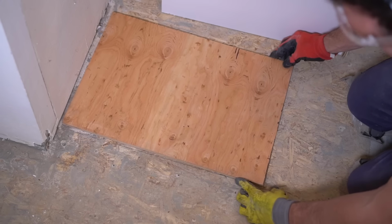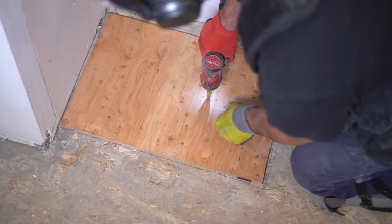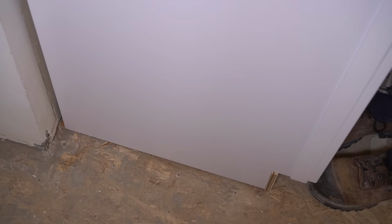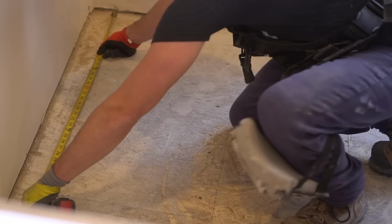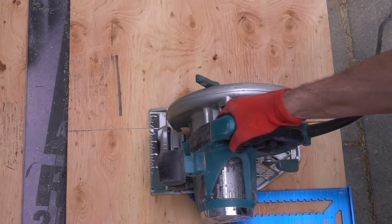However, we do want to make sure we have proper height, which more accounts for your countertop height, because if you didn't have this and you just installed your kitchen cabinets and then ran your flooring to it, you'd actually be losing height of your cabinets by at least a 1/2 inch. This way we're rest assured to have the appropriate height of our cabinets once our flooring is in, because we've already accounted for that variant.